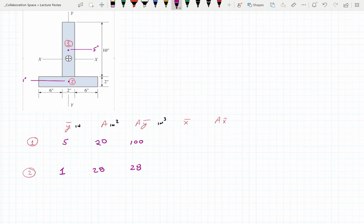Yeah. But what you don't get is where the center is. That's part of the problem. You've got to know where the center is. On the first shape, the centroid was across that x-axis, where 0 was. That's why I went out to 18.5 and divided in half, got 9.25.